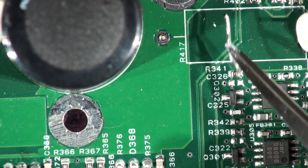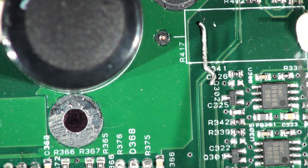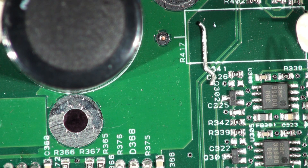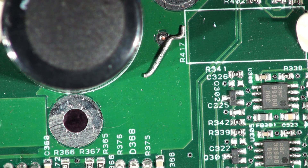Maybe this resistor was just faulty and had very weak, work-hardened copper — it's copper wire, tin-plated copper lead. Watch out for that because you get stress fractures from the vibration, and it's worth checking before you even start doing anything to make sure that resistor is in good nick. I find that interesting because I've noticed them being bent or slightly wonky before, but I've never really considered it a problem. I've fixed maybe a hundred of these or more, but I've never seen a broken resistor until I looked at another one yesterday — you could tell the resistor wasn't really anchored properly, you could feel the leads were on the way out.